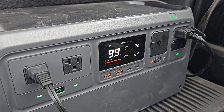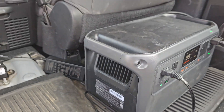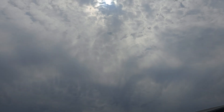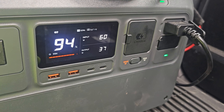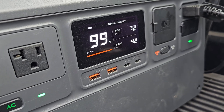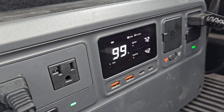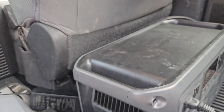It is late in the day so my solar input is lower than at midday. I ran it while it was cloudy — just a light haze — and the lowest I saw early in the morning was 35 watts. Even when it was still cloudy later in the day, it was still pulling around 60 to 70 watts. The fridge pulls a maximum of 45 watts, but it's not constantly running — it cycles on periodically.